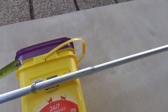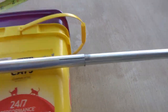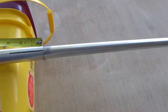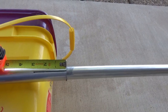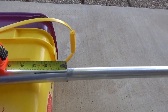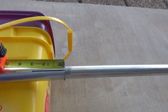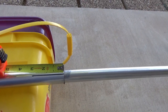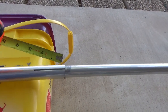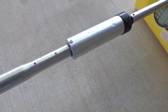I've got everything lubed up now with this aluminum anti-seize. One measurement I'm going to do right here is between section four and section three — I'm going to measure two and three quarters of an inch. That's the measurement needed for the 50.1 megahertz area where the voice portion is. I've got the grease on here now, so I'll go ahead and put the screws in.